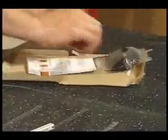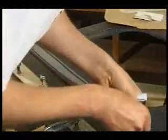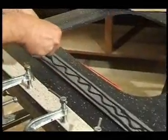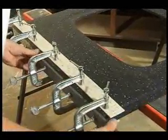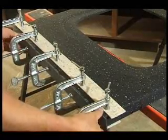Mix the adhesive well and pipe it onto the edging. Make sure there is a good bead of adhesive around the edge of the strip, and then fill in the center portion with a suitable covering. Feed the edging under the row of clamps and hand tighten the lateral part of the clamp. You should see the adhesive squeeze out of the edges.